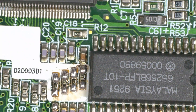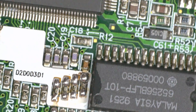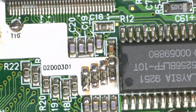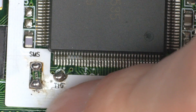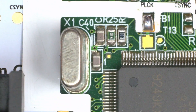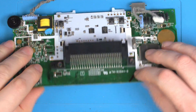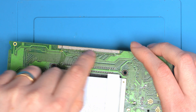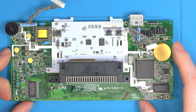Do a quick visual inspection and clean up with IPA everywhere you've soldered. The solder joints look fine — there's a bit of excess solder on one resistor but it's not touching anything. The SMS pin looks good, T10 looks good, no shorts on any of these pins. Peak lock, left, and C-sync all look good. You'll notice there's no need to go onto the back of these connectors, though you still need to make sure there are no shorts on the pins. Once you've taken the ribbon off, check there are no shorts between pins — otherwise you'll have issues.